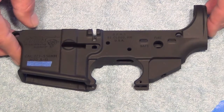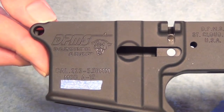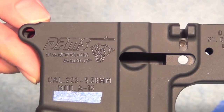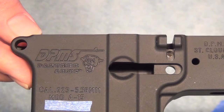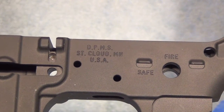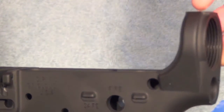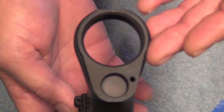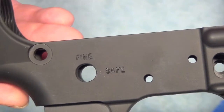There are only a few companies that make AR-15 lowers. One of these is LAR Manufacturing. I believe that LAR Manufacturing also makes lowers for Bushmaster, CMMG, Double Star, Spikes Tactical, and a few other companies. What I found out about this lower is that it's made out of 7075 aluminum alloy tempered to a T6 rating, which is mil-spec unless I'm mistaken.